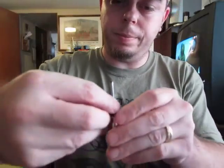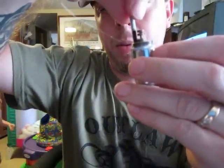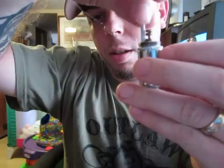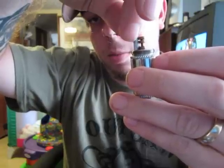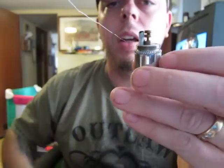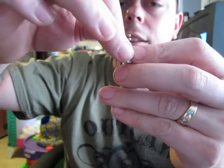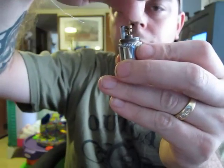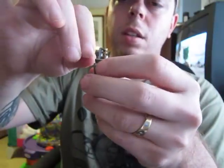I've got quite a bit of rolling paper on there. I'm just going to try my hardest not to let this stuff bunch up — looks pretty good. Just rolling it the same direction so it doesn't come unrolled. I'm going to push this into the tank until I feel it hit the bottom, then lift up just enough to make it even with the top nut.